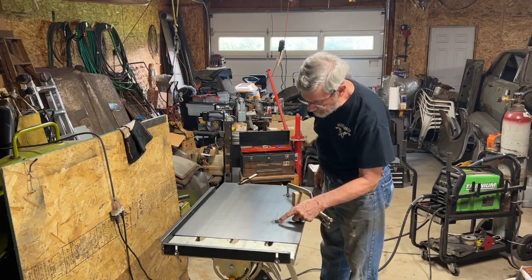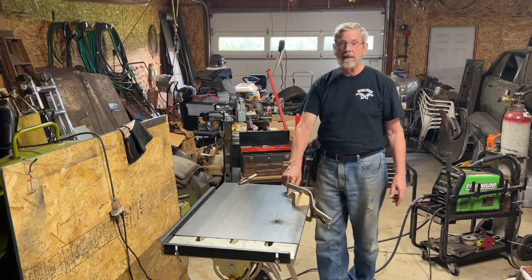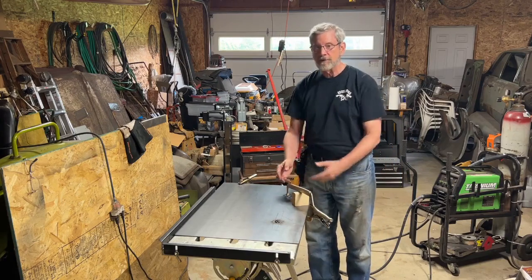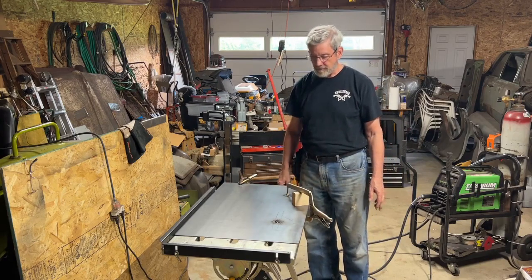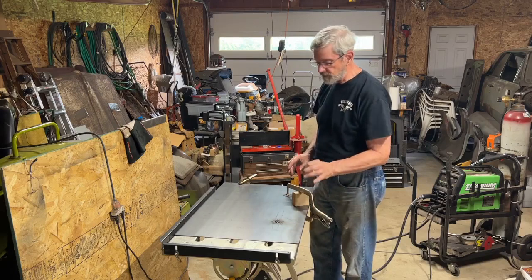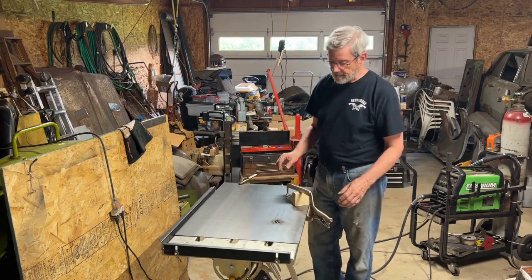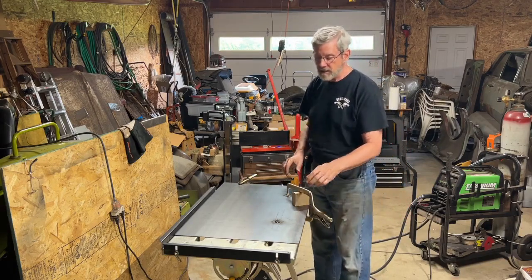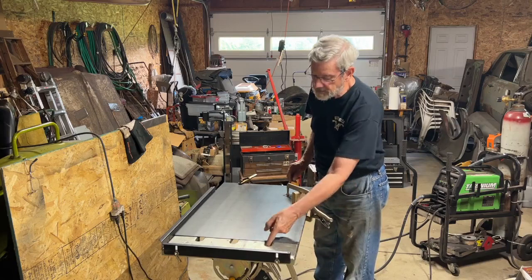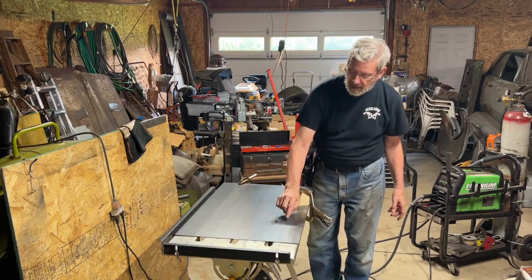The weld is kind of ugly over here, but it works. On this side, when I welded these two washers on, I tried to get a nicer weld and forgot that in doing so I welded too close to the center, so now the nut won't fit — I'll have to grind and file that weld off. When I put these on, I put two washers underneath to ensure full thread engagement, but made sure it wasn't too much — the nut has to sit less than half an inch from this flange surface.